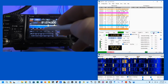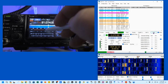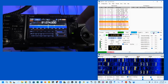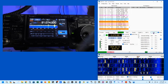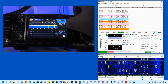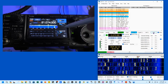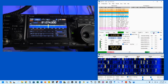What we're going to do is set our ALC. This is full scale on the ALC. I should have 0 compression, a very low SWR, something less than 1.5. So now I'm going to press my multi-knob button. I'm going to select RF power, and I'm going to turn that up to 40%. Since we are on a 0 to 100 scale, 40% is 40 watts. Exit out of there, and now we're going to come here and we're going to click the Tune button.